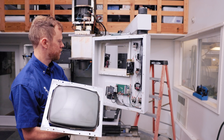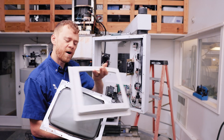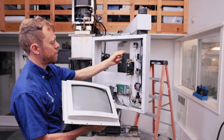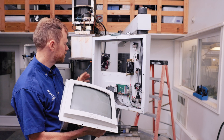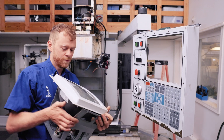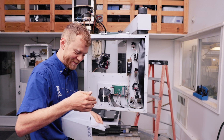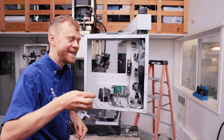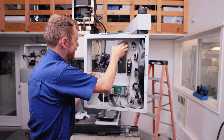Get this unplugged. Here's the bezel. If you're working on a machine that doesn't have a bezel — it's recessed — it'll have bracketry about this tall to adjust for the curve of the screen because the screen fits a little further back. Those machines, when you're looking at them from the front with the upgrade, have about a one-inch gap in between. So let's set this down and pop the new one in. I've seen several people do screen upgrades on FANUC machines and other machines with a big fingerprint on the inside of the screen, and that's just annoying. So let's keep fingerprints out.